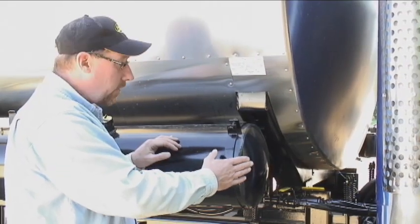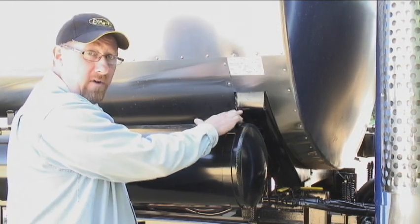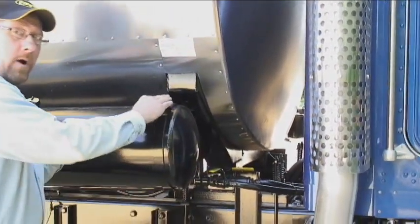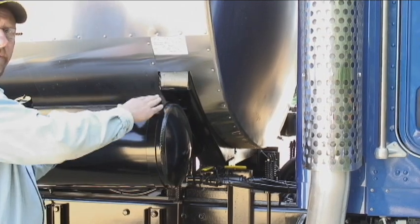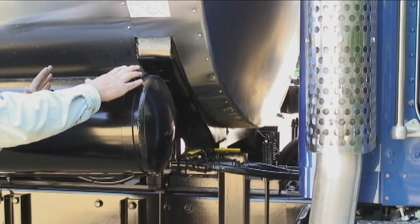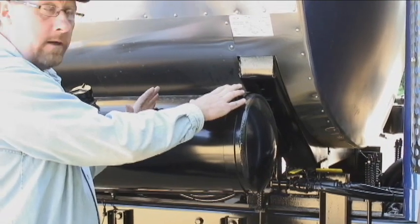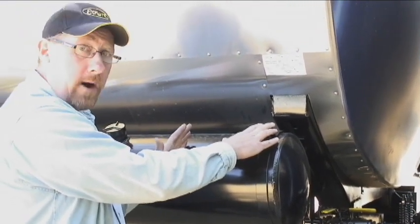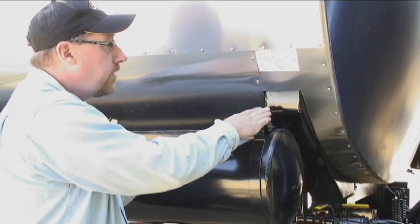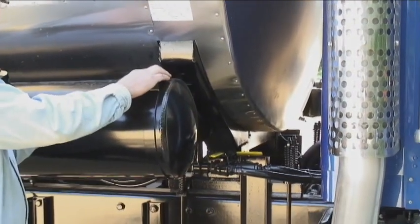Located in front of the diesel tank on the right hand side are the valves that control the optional anti-freeze asphalt pump heating system. This tag will explain how the valves should be set. Basically, we're taking truck anti-freeze, running it through a heat jacket around our asphalt pump, around our sump, and around our drop tubes on our circulating system, so that the anti-freeze is preheating that material to 200 degrees prior to putting asphalt in your asphalt pump.